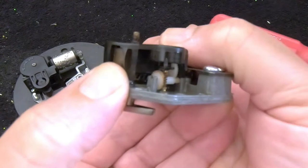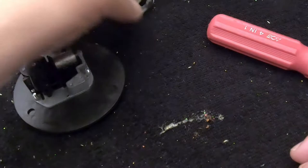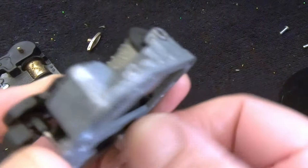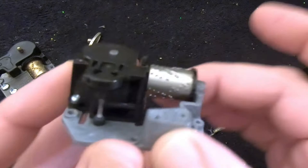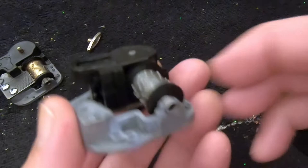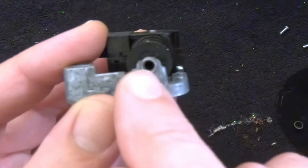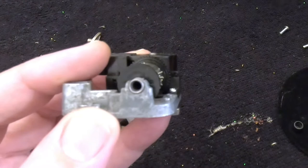There's more damage — more rusted damage than we thought. So we're going to remove all of this like we did before. Here's the music box removed from the cover with no comb on — you can see the governor spinning there, keeping the barrel turning at a steady rate. So I've got this loose now. The next step is to remove this barrel and transfer it onto the working mechanism. This barrel is held on by two pieces of bent metal crimping it — unfortunately not one of the nice ones that screws in.